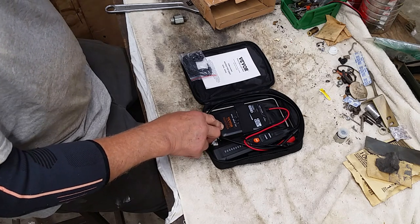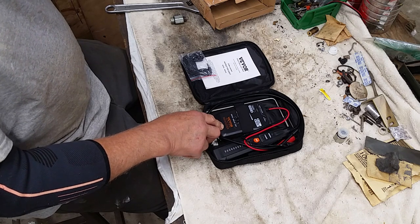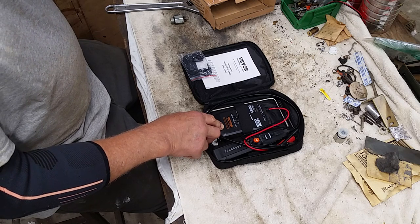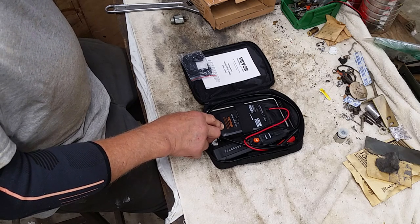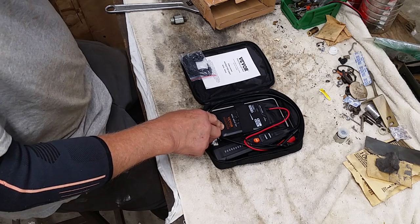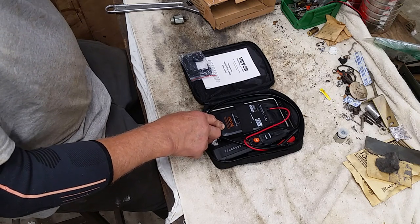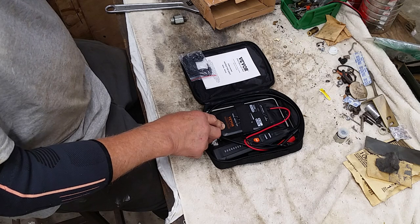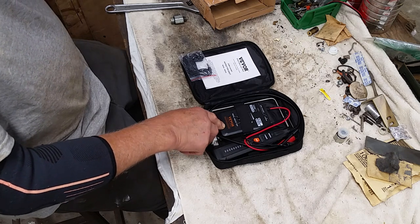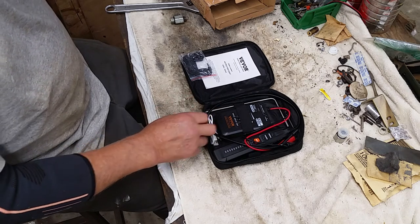Unfortunately, in the garage, if I had done that, it comes up from my basement, goes up to the top of the garage across the ceiling joists, and then back down. So it also would make a great antenna. So in essence, no matter where I put it, the piece underground was connected to two really good antennas, which made it really difficult to pick up just the signal from in the ground.